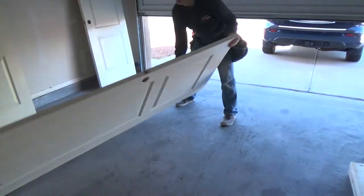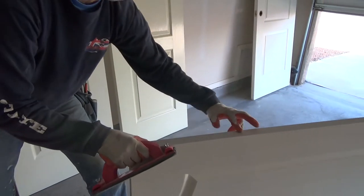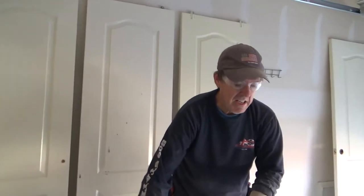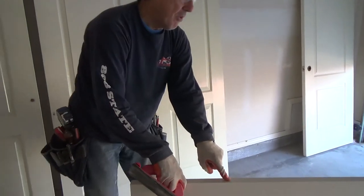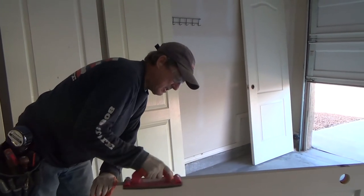Now I'm going to take this and flip it like that, do this edge, do the top. It doesn't take very long. On doors you'll notice there are two little indentations there, kind of bulged up — and two more down here. That's because on most doors when they're pre-hung, they've got one or two nails that tap the edge of the pre-hung door jamb and then they pull them out. The painters before they painted this didn't sand this edge down. So now I'm going to try to take that down just a little so it's not going to show.